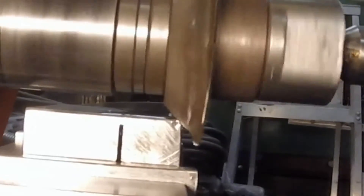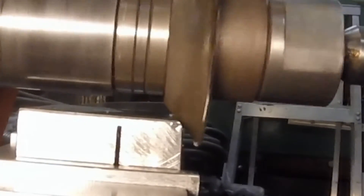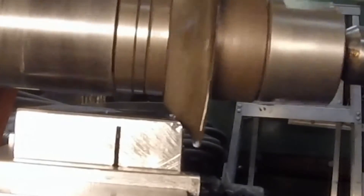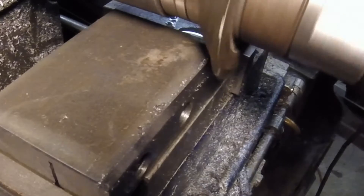But first I want to cut a relief on the back, because this does sit in a tool holder — which you'll see towards the end of the video — and I just didn't want any sharp edges on the bottom to cause interference problems. So it's back in the Burke for that, and it leaves a really nice finish.